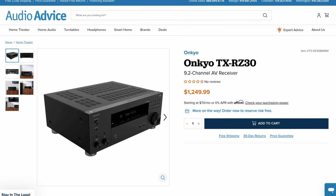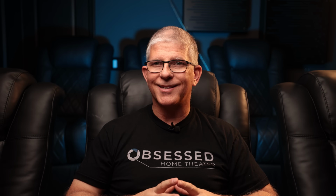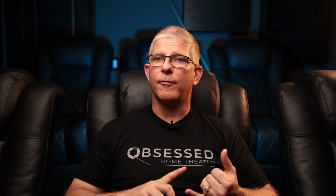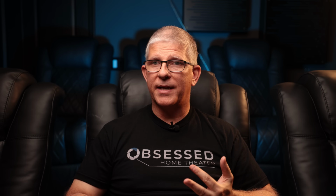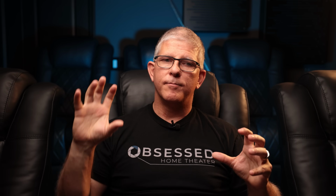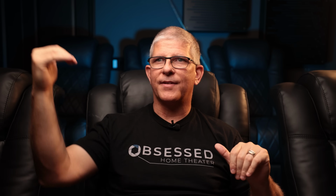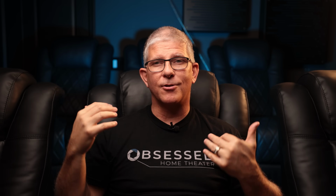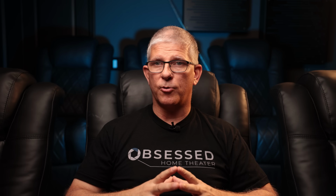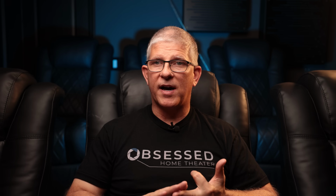Again, not super inexpensive because it's above $1,000, but it's still affordable. It's still attainable. And so with that, I ran Dirac Live with bass control, and I tend to add about a 5 dB boost on the low end. So I add a house curve to accentuate the bass frequencies since our ears aren't as sensitive to the lower frequencies. So when I ran Dirac, I did a 3 dB, a 4 dB, and a 5 dB boost, and I save those as presets.